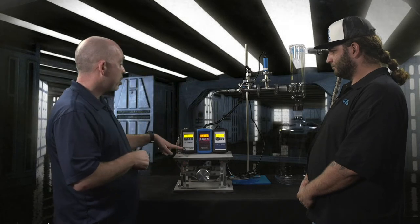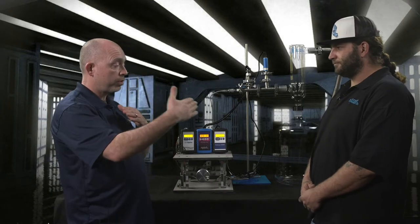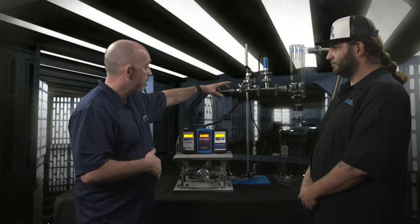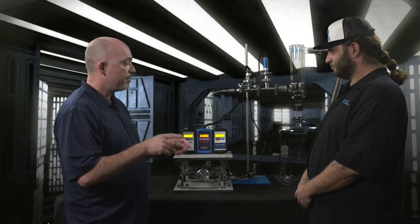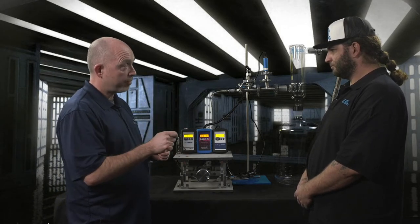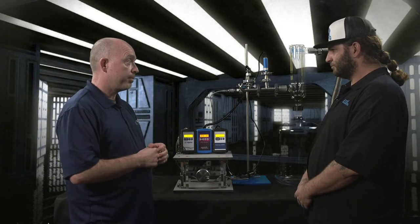When you want accuracy in that range, you go to a piezo gauge — it's a different kind of sensor. The sensor has an isolated diaphragm. This one connects to the piezo gauge, and the whole purpose is to give you really accurate, very safe readings all the way from about one millibar up to a thousand millibar, all the way up to atmosphere.